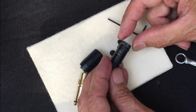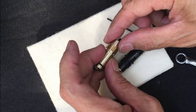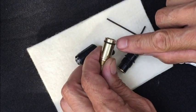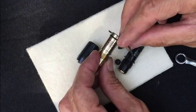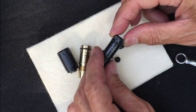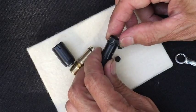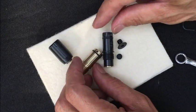One time I snapped this off because it was on tight on the action. So what I did was I made one in aluminum bronze, and to make it beefier without that weak point, I just put a hole here and use an Allen key to fit in there to tighten and remove it. So be careful removing this — make sure it's a really tight fit around the hex. Maybe get a really precise adjustable wrench and get really tight on there; if you start stripping it with the wrench going over it, it's going to look ugly.